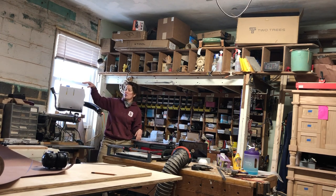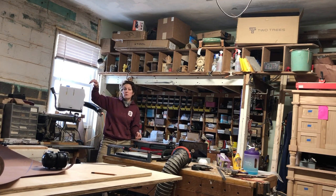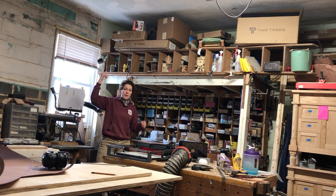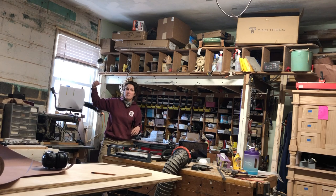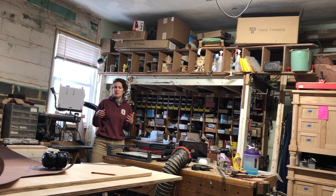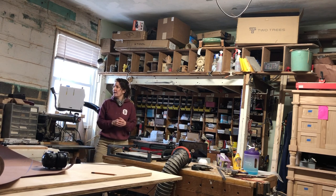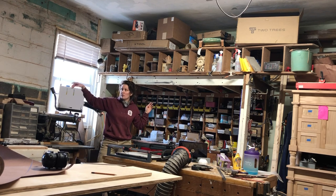On this side wall there are two identical windows, but the bonus is they are newer double-pane windows — you don't really feel any drafts. The rest of the shop, except for the insulated back wall, is cinder block on the inside and brick on the outside. The walls are thick, but cinder block and brick each have an R-value below 1, so not a lot of insulation.